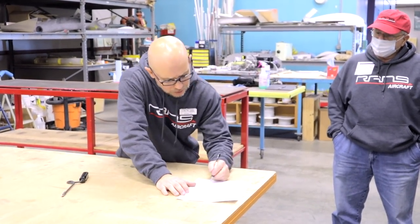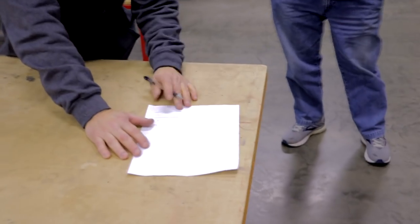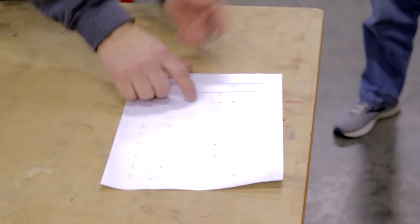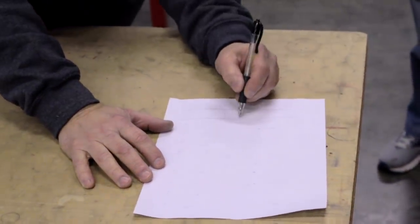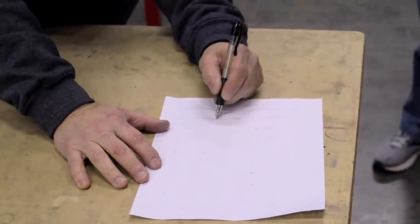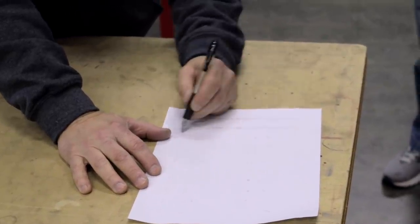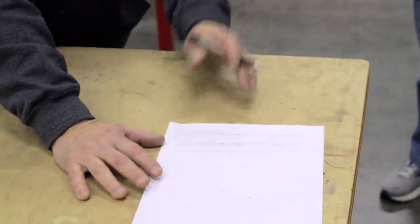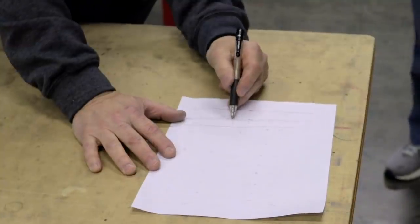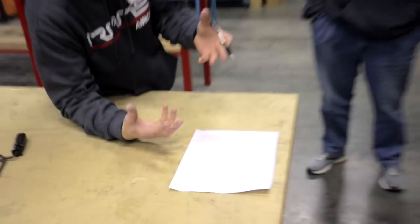So basically, when we have a surface, I'm attempting to draw a cross cut of a sheet of material that we're drilling into. This is amplified. But when we drill a hole in this, and we create, let's say, a little burr, sometimes it's on both sides. If we were to sandwich another piece on top of it and try to run a rivet or a fastener through it, be it a screw, a rivet, whatever, the stuff that's in it, that little burr, is what we would call an unstable matter. It can be squashed, it can move, it will render not a tight, precise fit, right?